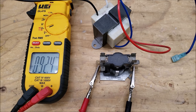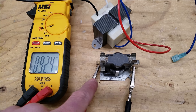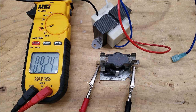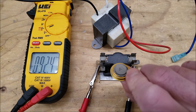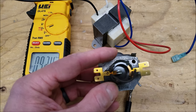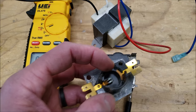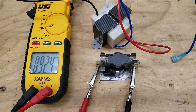In reference to troubleshooting, you can check to make sure that you don't have OL from one point to the other where you connect your 24 volts. Basically you're checking the resistance value of this little pan heater from one side to the other. If one of these little brass parts melted or something like that, that's why you'd read OL — and if that's the case, the sequencer is no good.